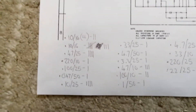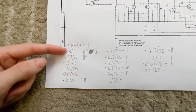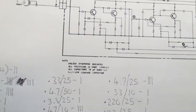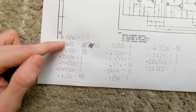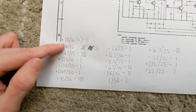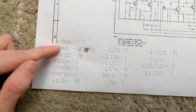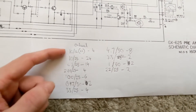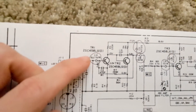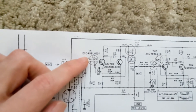For example, I've got a line here for 10UF — and I know it's UF because it actually says here that all capacitors are in UF unless stated otherwise. So that's two 10UF 16V, but we also have 10UF 25V, so I've just reduced it down to ordering more of the 10/25. Those ones marked separately are a bit special — they're the low leakage ones, marked on the schematic as low leakage. You can see this one here has LL in brackets, which stands for low leakage.